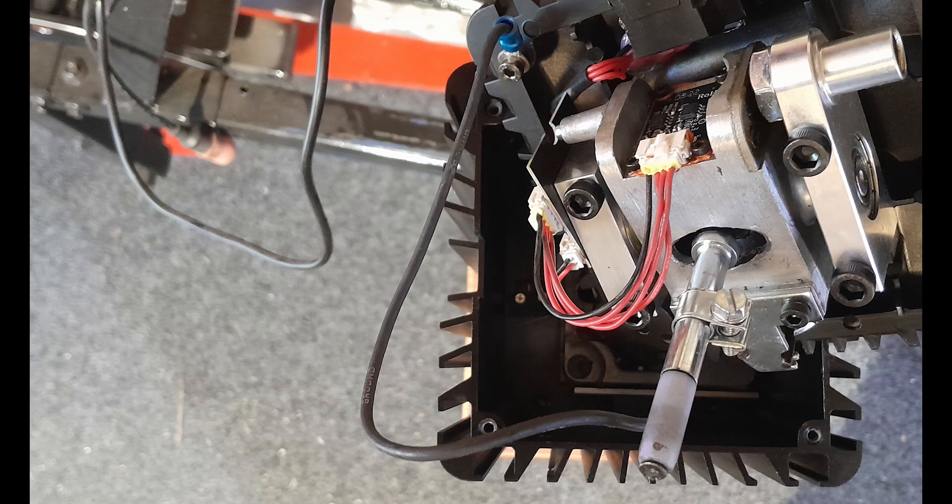To stop it from building up static, you need to get the shaft grounded. This is a fix I came up with 12 months ago. It had been in place until the last two days when it started to misbehave again. I disassembled it and you can see the little clamp on here — it's a little hose clamp. That had come loose, and we'll go into what this is all about — how to ground it. That little clamp had come loose, so it wasn't grounding correctly.